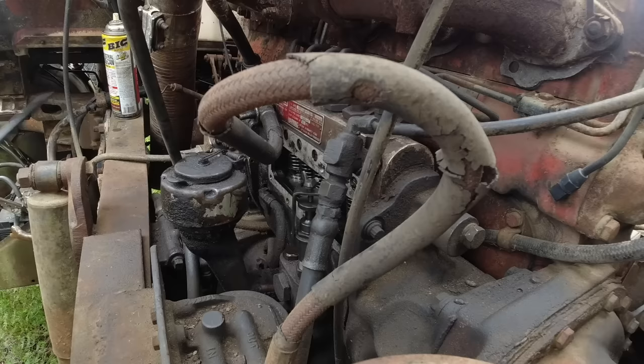The exhaust valve on number one is loose. The intake valve is loose. On number two, the exhaust is tight and the intake is loose. Hank, I'm on the compression stroke. In other words, I can tell the difference. Yeah, that's right. When it's moving, it's making it go back. So that should be top dead center. And it's like at 5 o'clock. Yeah, 5:30, not quite 6. And it's got to go back till 2? Yep.